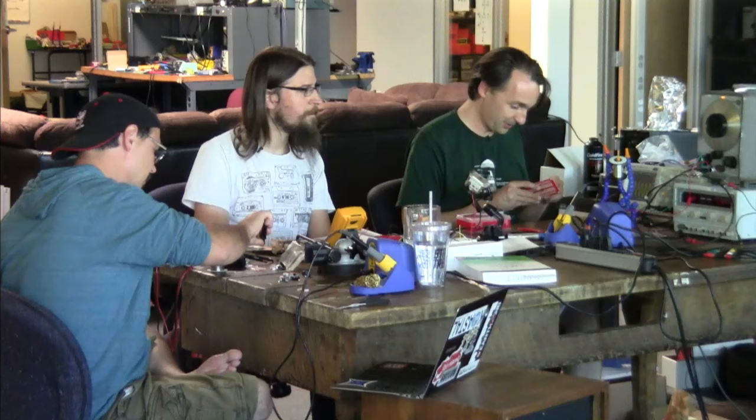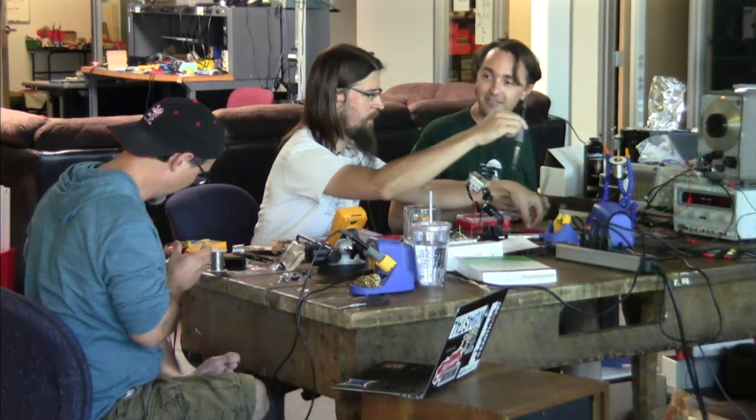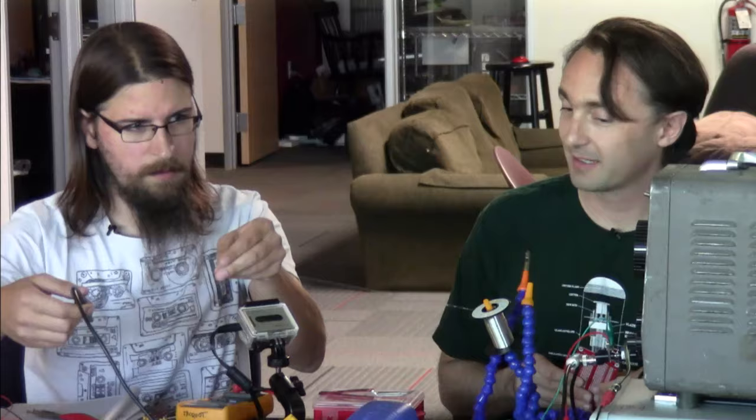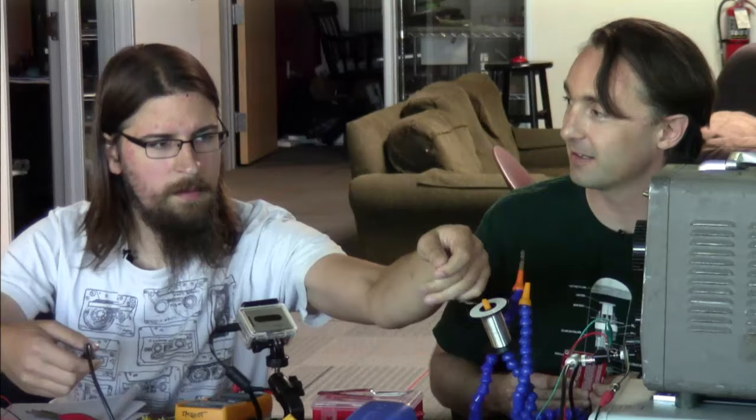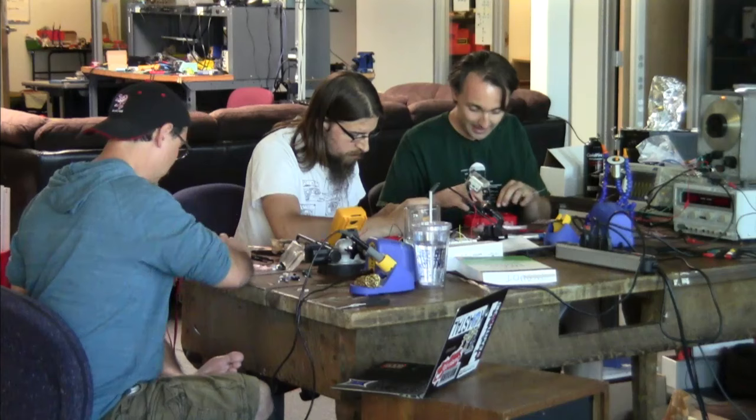That's actually one of the classic problems in audio, people repurposing existing connectors for other things. Like a professional microphone will use a 3-pin XLR, but I have seen high voltage power supplies that use exactly that same connector. Oh, yeah. And you certainly wouldn't want, in the heat of the moment, producing a live show perhaps, to confuse them and plug the wrong one in.